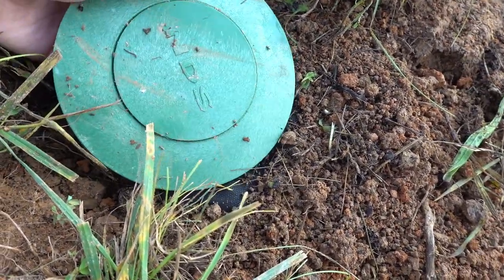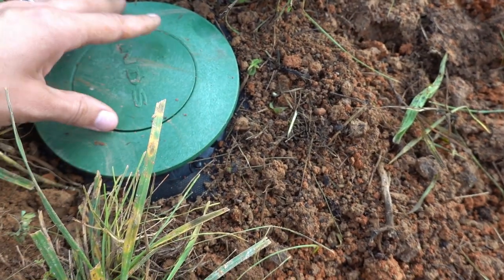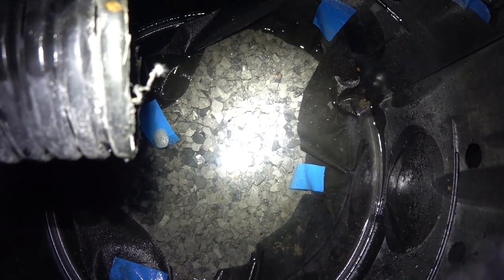There you have it — it doesn't look that great right now, but we're going to get some topsoil and grass seed and it will look just fine. If it overflows, this lid will pop up and water can overflow off the edge instead of always shooting out. It will only shoot out if the whole dry well is full, and we can always check inside if we need to. It's been a while since we installed it, but it's the first steady rain — about half an inch over the past 24 hours. There's some water in there, basically just around the base, so it's working.